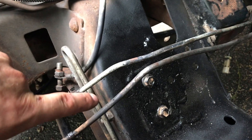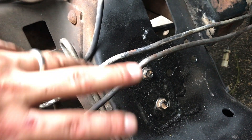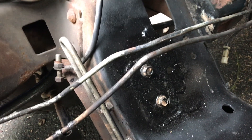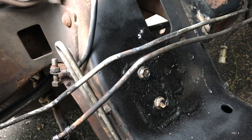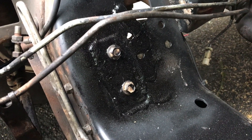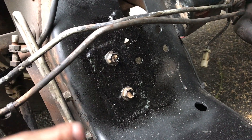When you drill through steel, always start with the smallest drill bit first and work your way up to the size hole you actually need. You burn out drill bits much faster when you start with a big one. Also use some kind of lubricant oil — in the industry they call it Molly D — and that also helps from burning out your drill bits. Trust me, it's eighth-inch steel, but you start doubling it up and you're asking for problems. So as you can see guys, just because you crack your engine crossmember, it does not mean the end of the world for your truck. This is something you can repair at home with some tools. That's all for me — hit the subscribe icon, check out some of my other videos. I'm Stevie from The Minute Masters, thanks for watching.